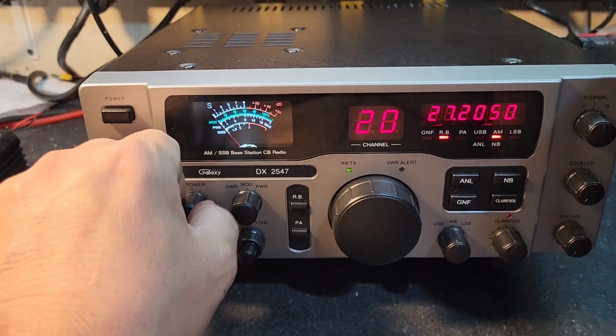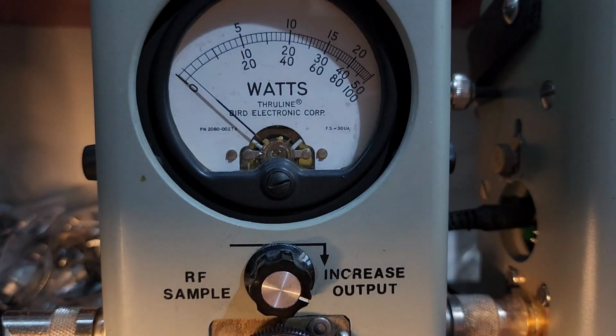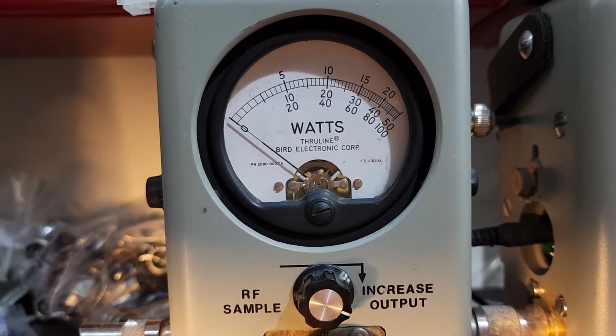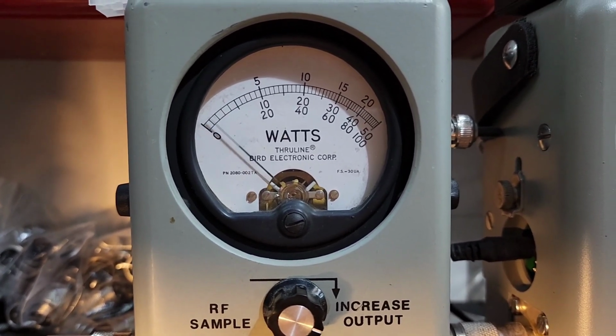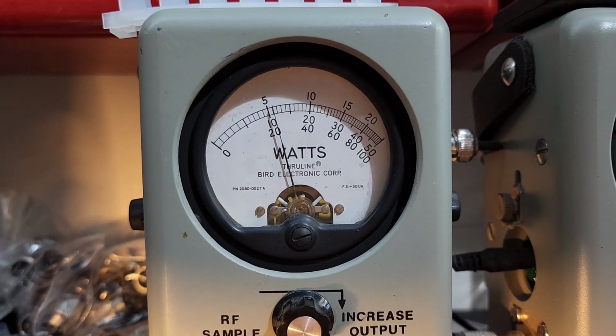We're going to start with the RF power all the way down. This is a single final radio, so we got you set here to half a watt all the way down. Now, that's lower than you're going to run it if you're going to be barefooted, but if you decide to run an amp, you do have that adjustability. There's your 5.5 watts all the way up.